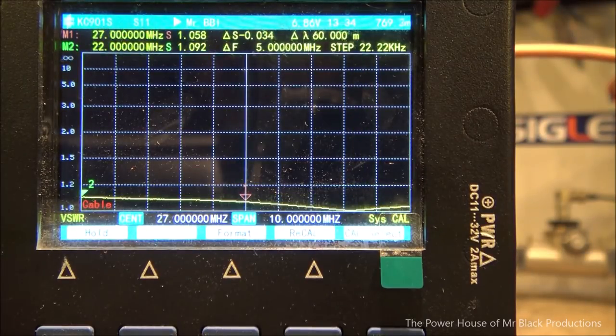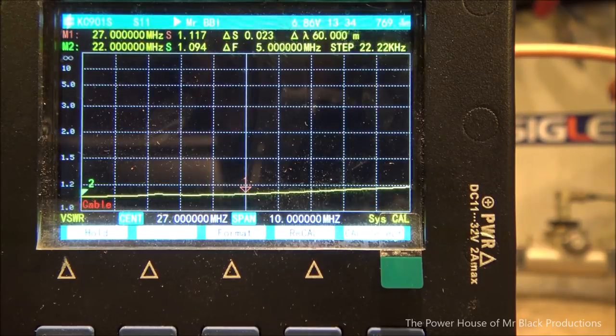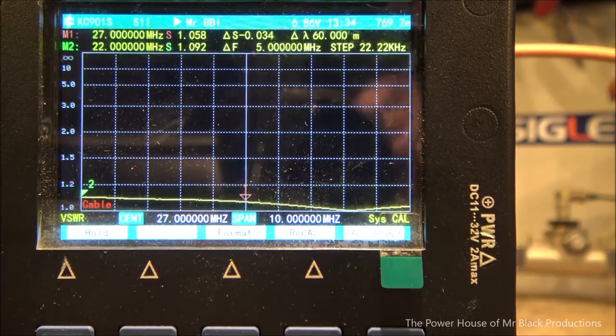That's what we're looking for. So you have that little momentary lag in there. It's about 10 milliseconds worth as the relay's opening and closing. Approximately the same amount of time it takes for the radio to energize and de-energize. So, we're set as far as passing through on the receiver.